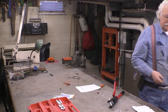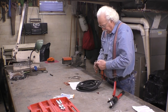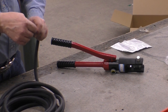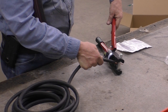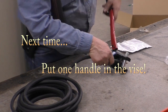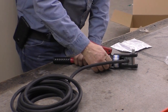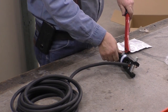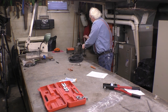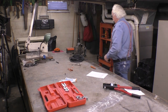Let's go down one size more — that was kind of a poor crimp, I didn't have it in the right spot. Let's try again — this is the last one I have. Let's stick this on there. Let's see how that's going to go. Let's see if it comes off. Nope — I'd say that's good. I can pull the insulation but I can't pull it out.